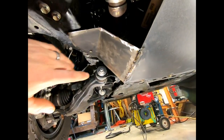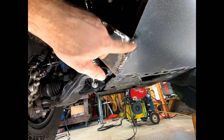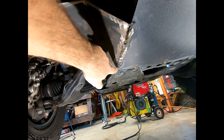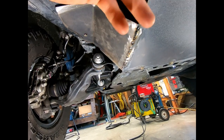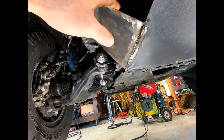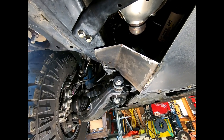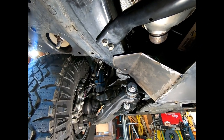First piece is in. I kind of got a little too hot on this section right here and blew through a couple holes, but I can fill that in a little bit later. Start here, here, and then here — it's just like any other stitch weld with some really thin sheet metal because you do not want this thing to warp. It does have enough bolts in there to actually straighten it out once you put everything in, but take your time. Pretty happy with it so far. Let's get the next piece in and try to bolt it all together.